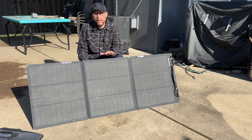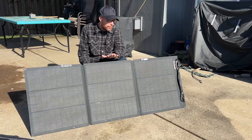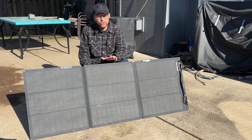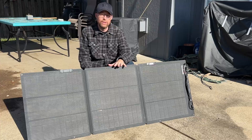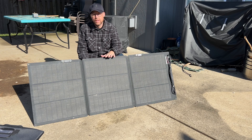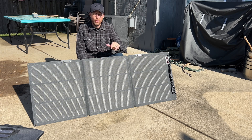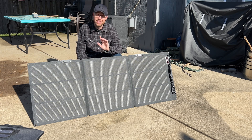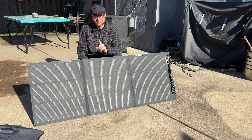In this video I'm going to show you the proper way to angle your solar panels at the sun, because you want to get that proper 90-degree angle. I'm going to show you how to use the integrated one that EcoFlow has in this 160-watt solar panel. They also have it in their 220s with their brand new series, but if you don't have one of the solar panels that has an integrated solar angle guide or a clip-on option, I'm going to show you something you probably even have in your pocket. So let's get started.